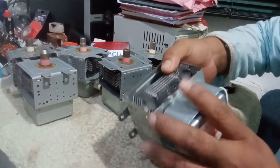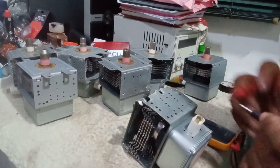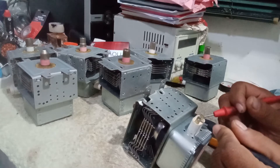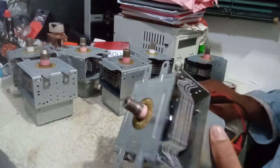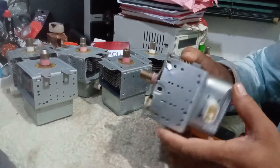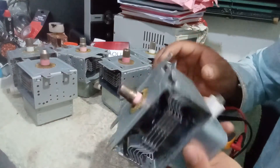This one is also burned, but if you check by meter it will show you okay. Both terminals are showing continuity and the body shows no continuity, so the meter says it's okay — but it's not okay because it's burned. That's why we have to check first by eyes and look at it properly.